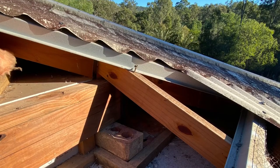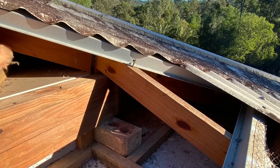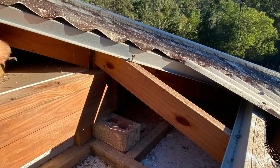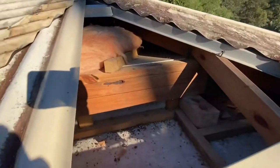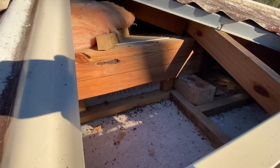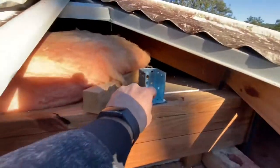You can see in the video that this bracket is going very close to the hip — the angled section of the house roof. We've lifted the roof sheet up to the ridge line, the highest point of the roof. You can see that rafter angling down the screen, coming from the top to the bottom — that's part of your roof truss. That rafter is sitting on a piece of timber called your top plate, and that top plate is where we want to get our fixing.